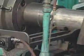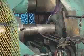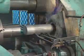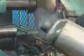Pressing the cylinder into a heated form creates the neck. The cylinder is single-piece construction, no welding. The tanks are then solution heat-treated to a T4 condition for 1 hour. A water quench and T6 aging process hardens the relatively soft aluminum alloy by changing its molecular structure.